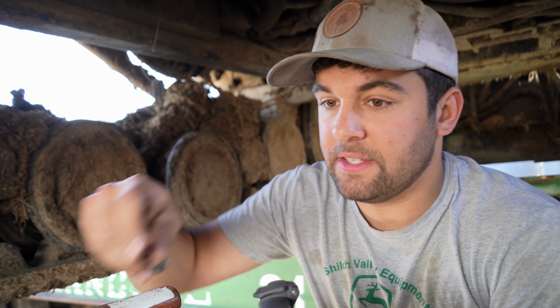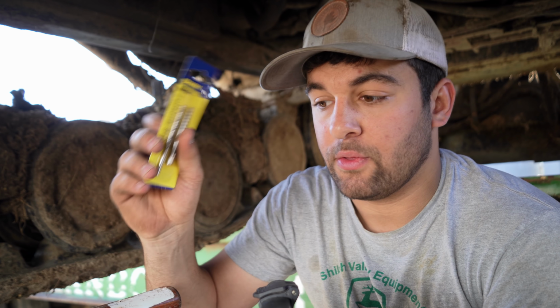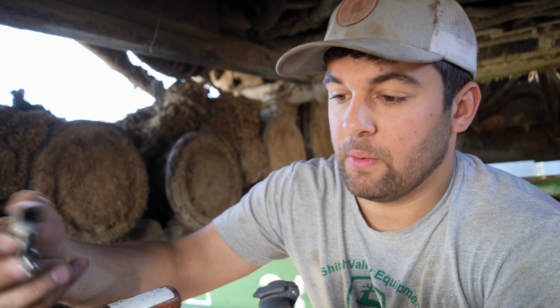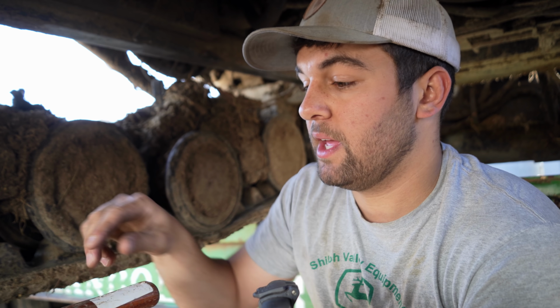Okay, so a little update. You guys can probably hear the generator in the background. We've run into some hiccups, both of which are my fault. So we got 3 of the 5 out, and I went to Lowe's and replaced Jake's extractor, and I got 3 more for myself, since I knew what size I needed now, and went ahead and broke off another one too. So we've got 2 bolts that were drilled for the extractors and have broken off extractors in them.